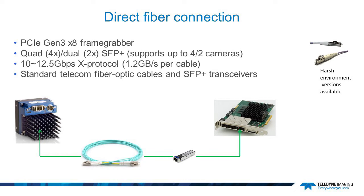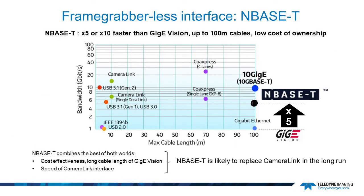They are very, very robust meanwhile, and a big advantage for industries where you have motors, electric fields, electromagnetic fields. They're immune to anything of that. So they're very popular, let's say, in the printing industry, where we have big motors running, and they're very cheap and easy to install and maintain. Standard transceivers, which are cheap, can easily support up to 300 meters or more, but you can actually go to 1 kilometer or even longer. So that's surprisingly popular. We just had this as an idea, but it seems to be accepted very well by customers.